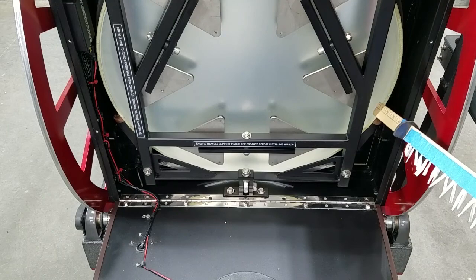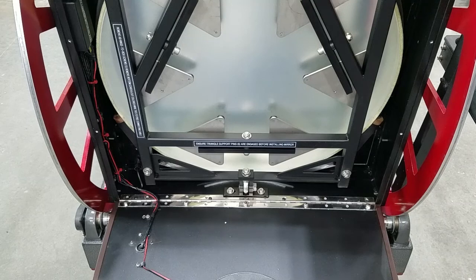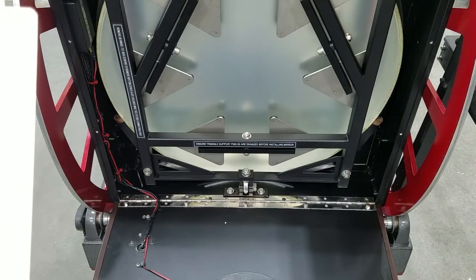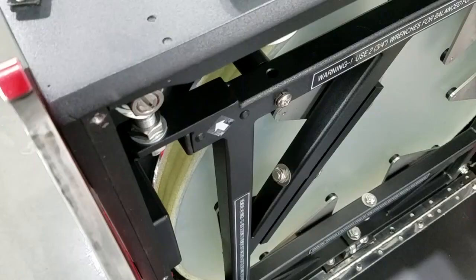This is a foam perimeter band installed for edge insulation — it is not glued on but held in place with a slight no-slip grip. The force required to hold it in place is about the same as a sheet of paper lying against the side of a mirror. The perimeter ideally should be insulated from the airflow to make heat removal more uniform across the entire mirror. This counters edge overcorrection for normal expansion glass, especially with falling temperatures.